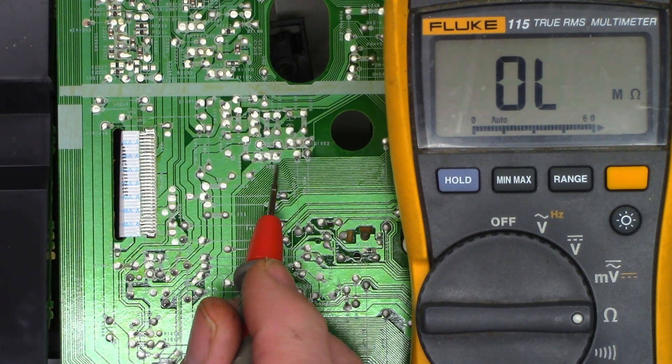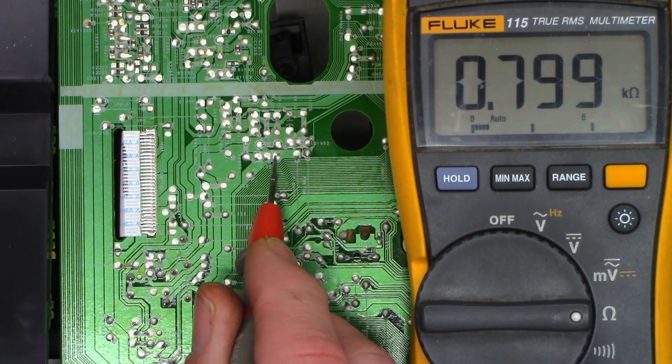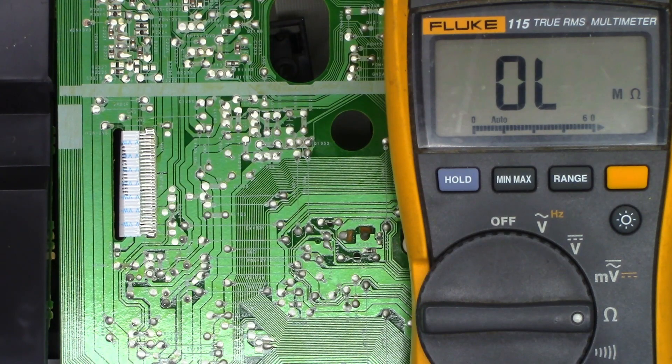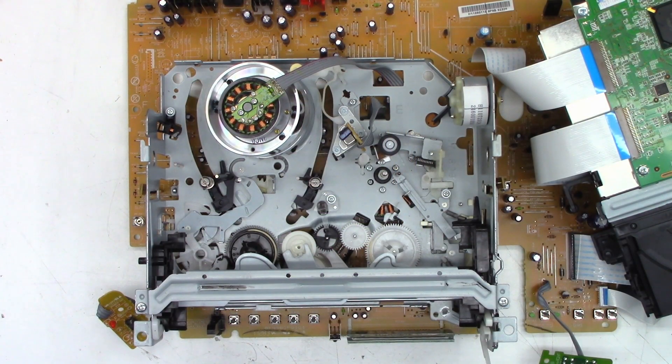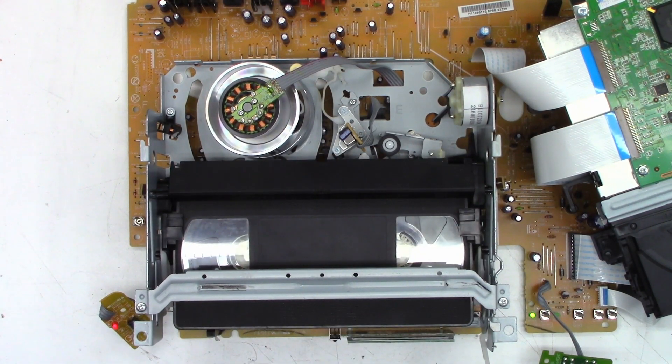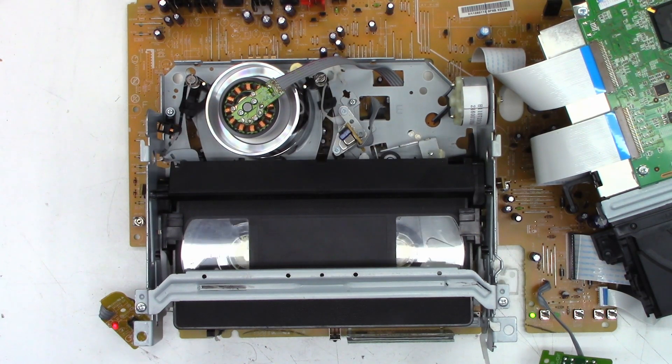New capacitor is installed. Let's go ahead and check the emitter of this transistor — we should see about 785 ohms, and we see 786. I'm perfectly happy with that. Remember last time it was like three ohms to ground. Let's go ahead and pop a new transistor in here, and I think this thing is going to be good. I have the unit loosely assembled. Let's apply AC power. I have a clock display, nothing else. Let's hit the power button — and the unit does actually turn on and stay on. Let's see if it'll load a tape. Yes, it did load a tape. I do have a monitor connected. It is doing auto tracking right now. Let's make sure it runs more than seven seconds before it shuts down to test the reel rotation sensors.